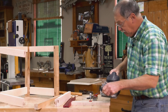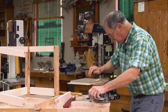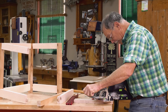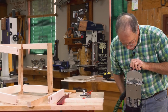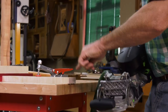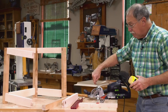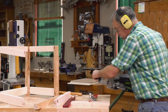The other beautiful thing about this tool is it's got dust extraction. You can unhook the tool right at the tool from power, plug it back in, lock it in, and it's powered up. What I'm going to do is use that spring-loaded stop as my stop up against this fence. The cutter is positioned on the fence so the slot is exactly in the middle, so I can flip it end for end. I'll make those cuts, and I'll do the same on the legs except I'll use a different setting to push the loose mortise up a little bit higher.